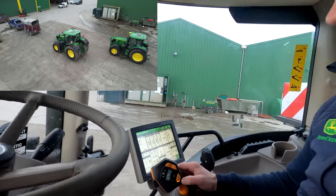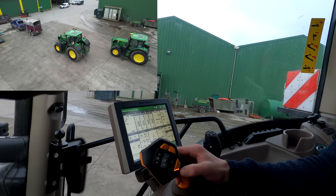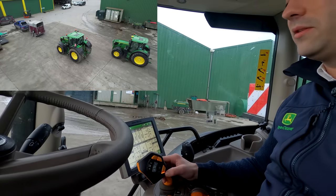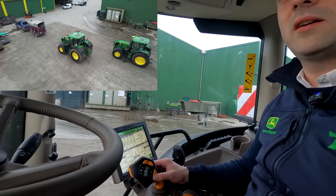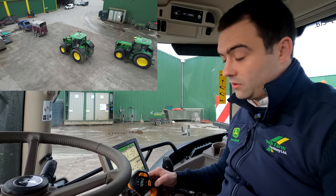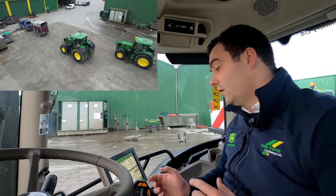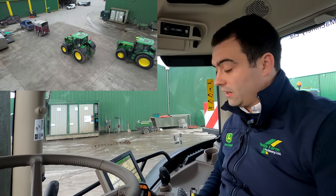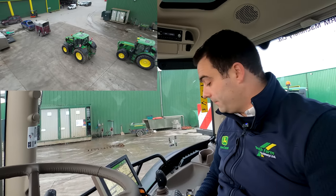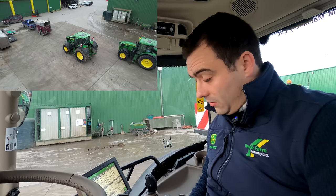There's also a cool orange light here about acceleration. To make it simple, the more lights you have, the more aggressive the tractor accelerates. So if you're coming out on a busy road with a big load, put your three lights on and you'll get maximum torque. Do the same thing with just one light on and you'll see the tractor is much more steady for taking off. It's altering how aggressive the acceleration is depending on what the operator wants.